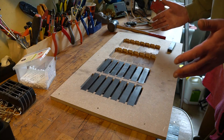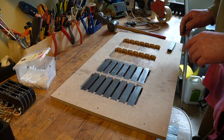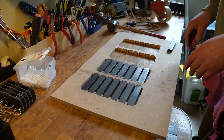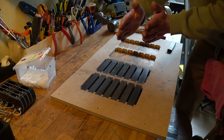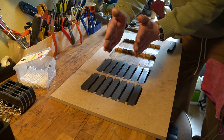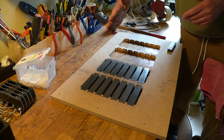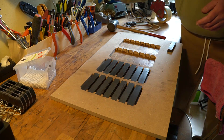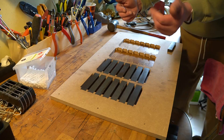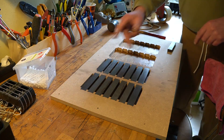That might have a benefit — and that's the whole test — but also a downside. You have to make two foils and stretch two foils, which is more work. The idea is that the foils move in tandem: if the magnets are here, this is a foil, this is a foil, they move like this — one foil at max excursion moves towards the magnet, increasing the field.